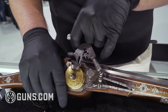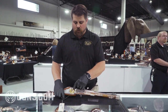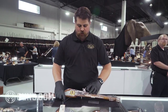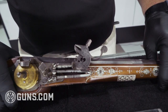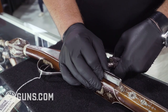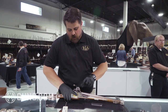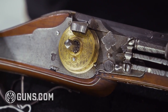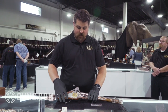This jaw would have held not flint but a form of pyrite — flint would have been too hard on the steel wheel behind here. So you've taken a form of pyrite in the jaw, held in place by this very large spring. I'm going to be very careful in operating this. You would lower it like that so it's resting on this large, essentially toothed wheel. When you pull the trigger it releases the wheel, it spins very fast against the stone, and lights your gunpowder.